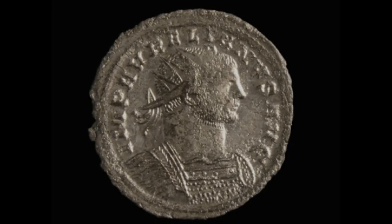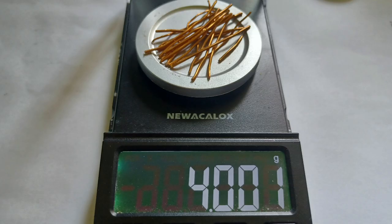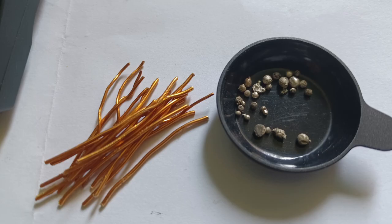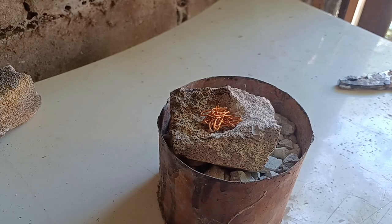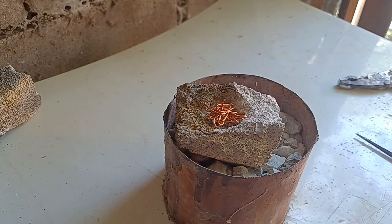I have decided to do a bit of experimental archaeology to recreate this interesting bit of monetary history. To do so, I weighed 1 gram of fine silver shot and 4 grams of electrical copper wire and prepared an alloy that contains 20% silver. I went with 20% because such an alloy was used in the time of Emperor Valerian, and the mint still managed to make it look like fine silver. To melt and alloy the metals, I used a MAP gas torch. I had to bend the wire to get it to fit into the small formed concrete DIY crucible I was using.